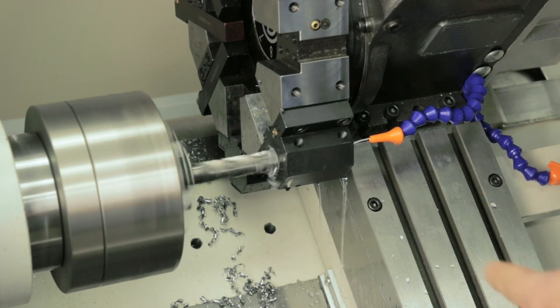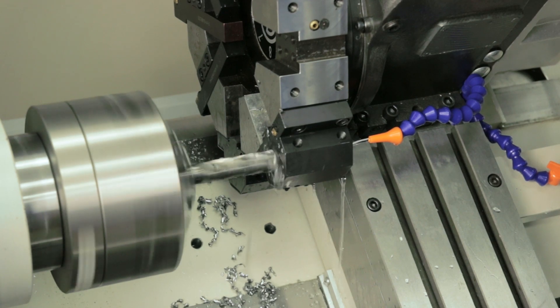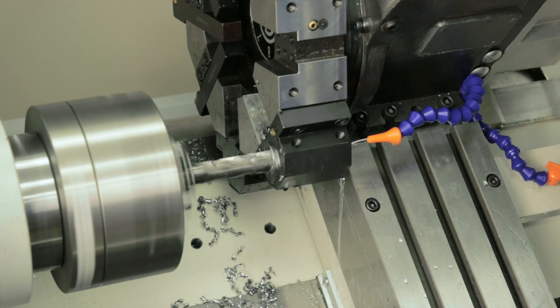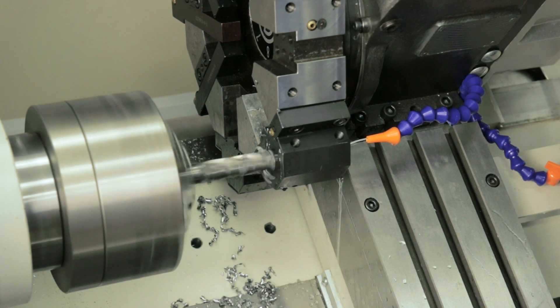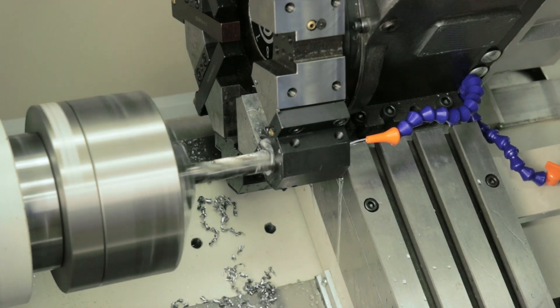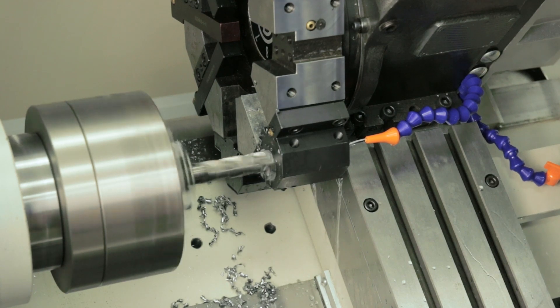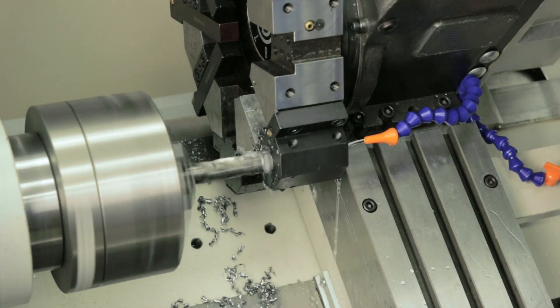If you're going to use a boring head to size them out, you do the same thing — just start out with a smaller end mill, like a 5/8 end mill or something similar. The reason we use an end mill and not a drill bit is we're not perfectly centered on what the existing hole was that came with these holders — we're more lined up with the set screws than with the existing hole. A drill bit would just want to follow the existing hole.